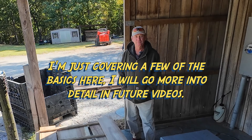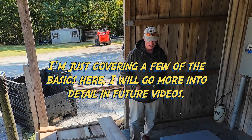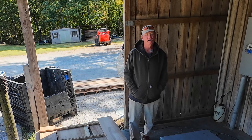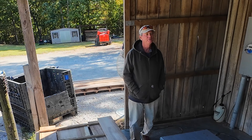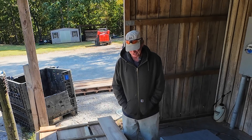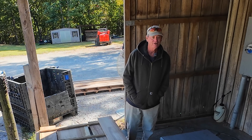There is a lot to properly air drying lumber. If you like to make things simple, stack it up, put it outside, come back a year from now — it's going to be dry. It'll also probably be full of bugs. It may have surface checks, end checks. It'll be warped, twisted. It may be sticker stained, enzyme stained, or even honeycombed.